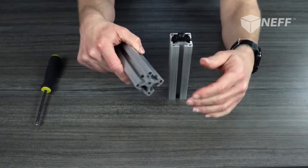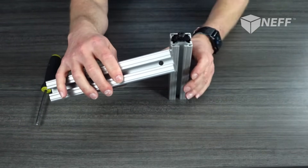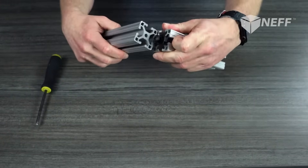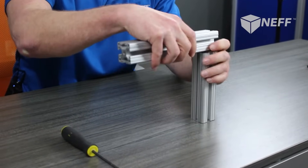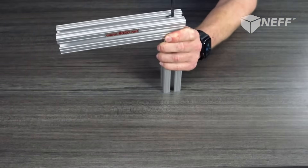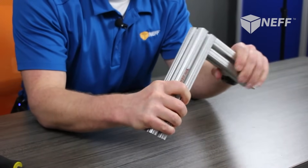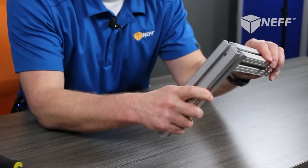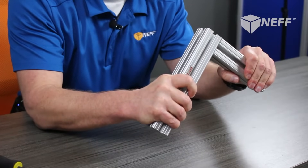You take your other extrusion — in this extrusion you'll see there's an access hole that's pre-drilled. That wing clip goes right into the T-slot. Get it nice and tight, and you've got a very strong connection. What you're basically doing is drawing these two joints together, using the extrusion against the other extrusion, and that's what's creating that extra strong hold with this end fastener.